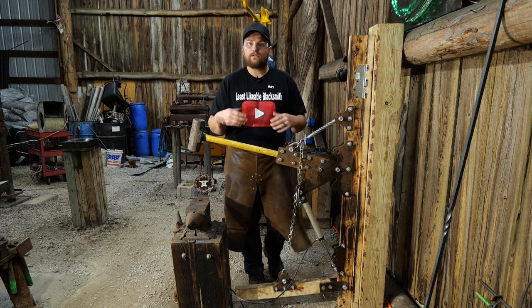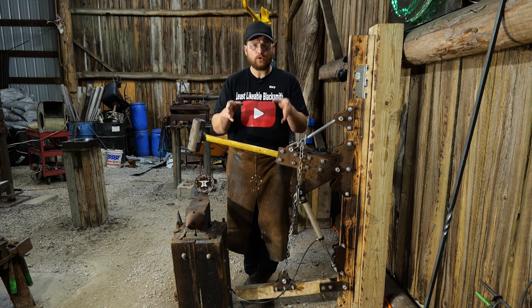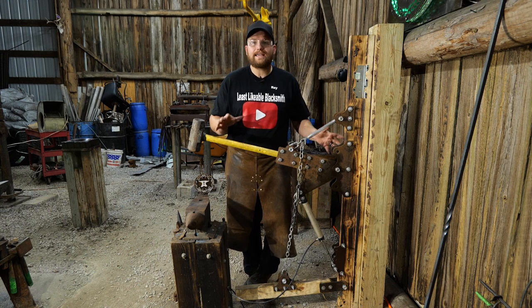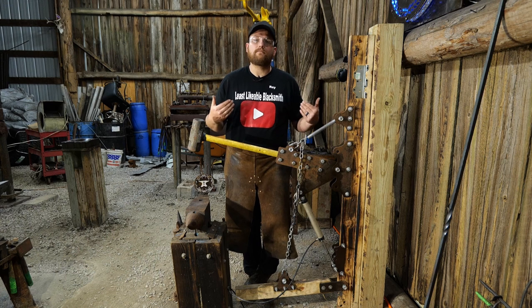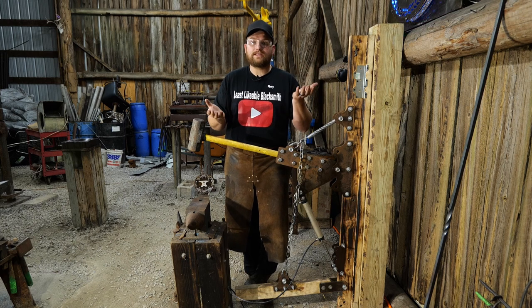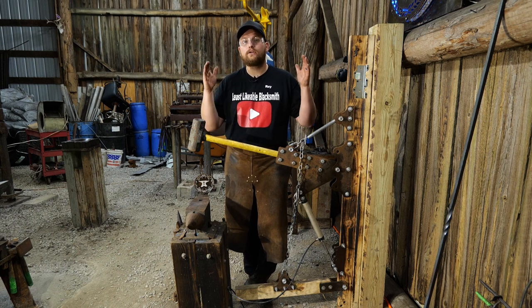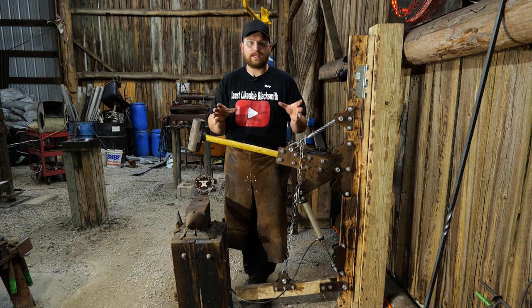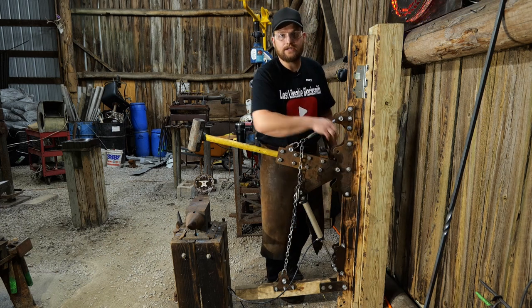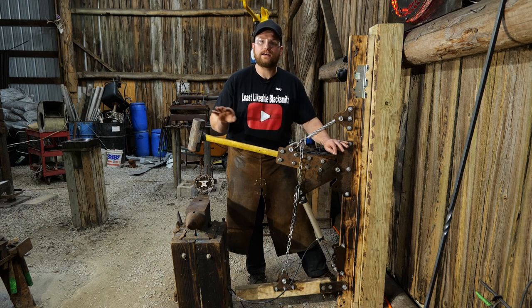When I did a build video for all of my customers who have purchased this air-assisted treadle hammer kit from me at blacksmithingblanks.com - the link is down in the description - I gave general measurements of my setup that work in my shop. My anvil is going to be different than probably what you're working with. So you need to set up the hammer to the correct height first, and that is all centered around this middle bracket right here. That is the very first step of setting up the correct height of the hammer.